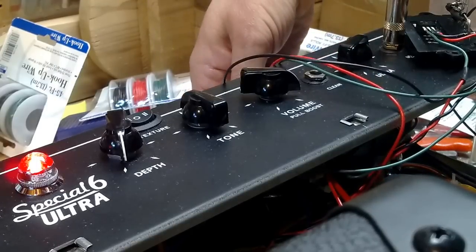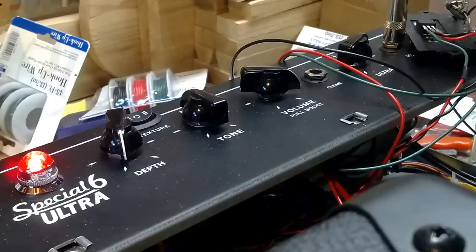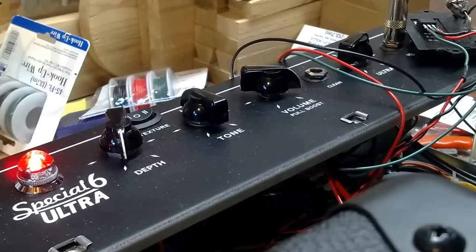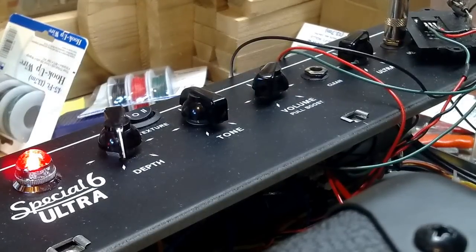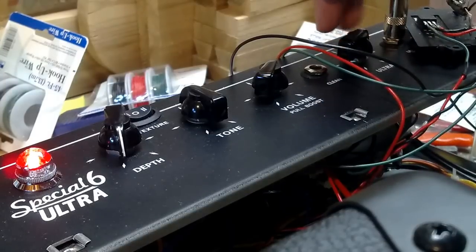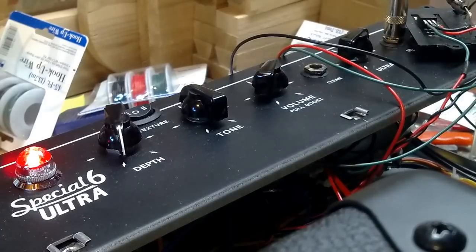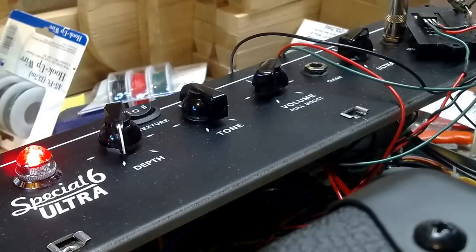That was almost all the way up; now it's all the way up. What I notice is that when I have it maxed — and you can control this by adding another series resistance on the output — I can hear what sounds like a little bit of distortion in the reverb. I don't know if that's coming from the input. It's certainly not because the input's too high since I have it clamped, and that level is well below the one-volt input, so the clamp isn't even impacting the circuit at the input. Could be the device I had — maybe it was bad.